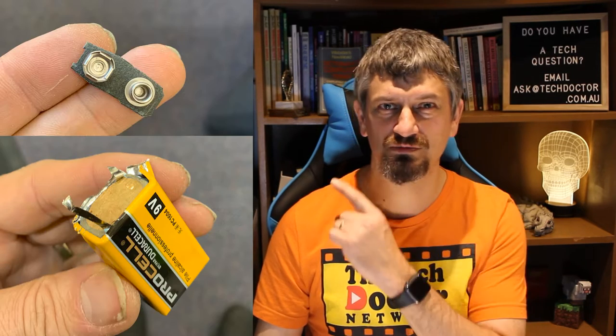I don't want to cut the cables off and there's no good way to attach to this connector. So I fossicked around in a box of old batteries that I need to take and get recycled, and found some old dead nine volt batteries. I was able to take the top of it off pretty cleanly like this. Then I did some slightly less than perfect soldering, trimmed it down and added a layer of heat shrink with holes cut out for the connectors. What I ended up with was this adapter and this plug on the end of it, so I can plug it in like this, plug it in at the wall, and have a powered cable tester. I even cut a notch out of the back plate so that I can tuck it away fairly neatly like that.